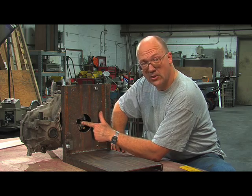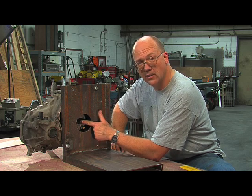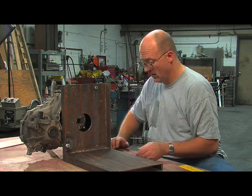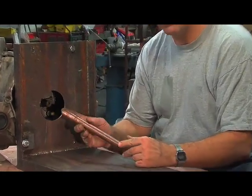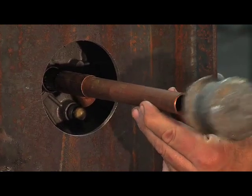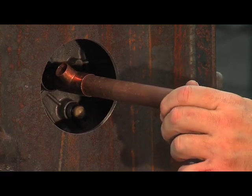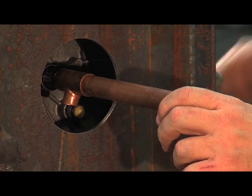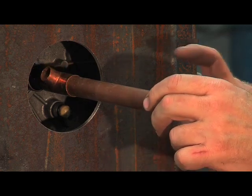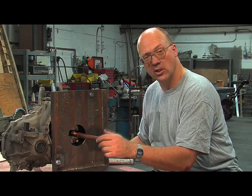In order to do that, I need something that slips onto the splined shaft on the transmission snugly. The coupler fitting does not fit snugly — it's supposed to have some play so that a little bit of misalignment or vibration doesn't get transmitted through. So I went through my junk pile, and the closest thing I could find was a piece of copper tube with a fitting on the end that is a snug fit on the shaft. I can snug that onto the shaft and slowly rotate it — as you rotate it, you can see when it's perfectly centered. The other option is to put a dial indicator on here and measure the runout of the shaft, which tells you how much out of round it is, allowing you to adjust it until you get it perfect.